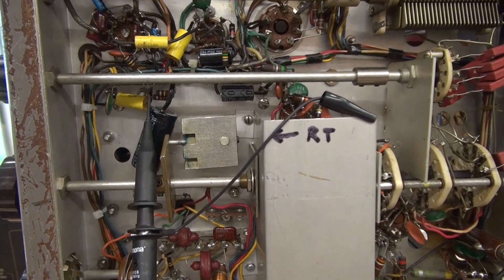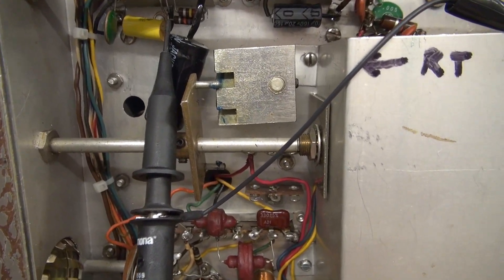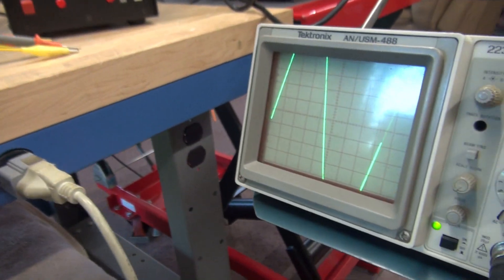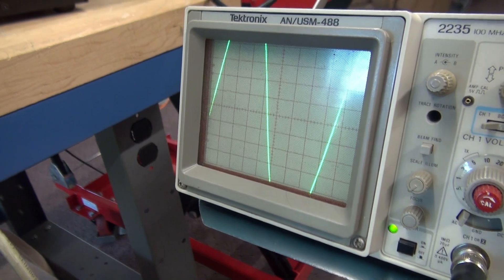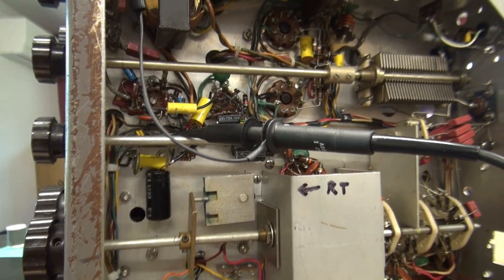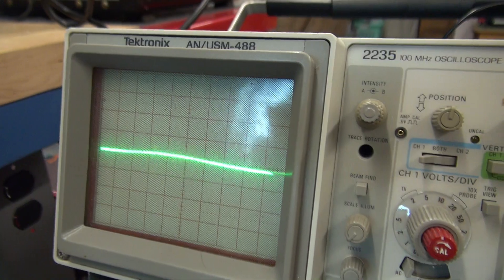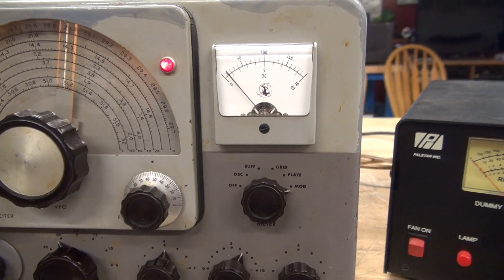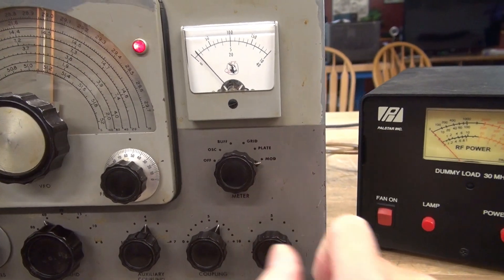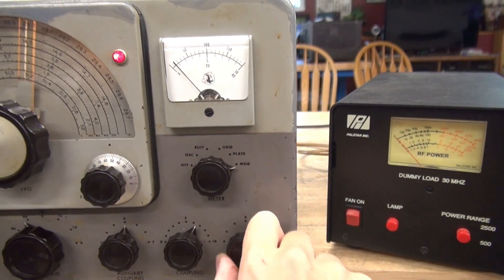I think I may have just found the source of our oscillation — it's actually a power supply ripple. There's this capacitor made by Jackson, which I've never heard of. I'm monitoring off it right now with the scope. Look at that — that's a lot of ripple. It goes right off the screen. I betcha that cap is causing all the problems. Checking that same point on the power supply after the filter cap's been replaced — you can see very little ripple. Going back and checking the modulation meter, I can advance the mic gain. There's no deflection. Now I'm going to key up the radio. There's my idle current — putting out full power. Let's bring up some audio gain.